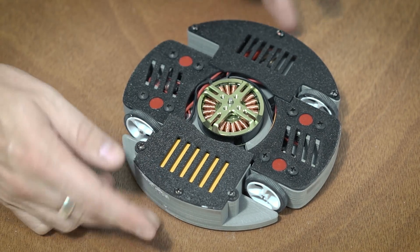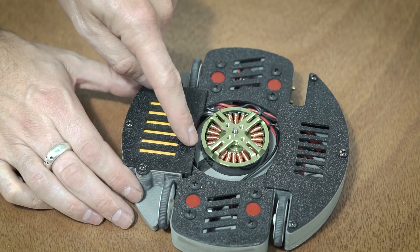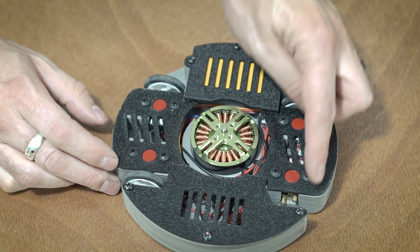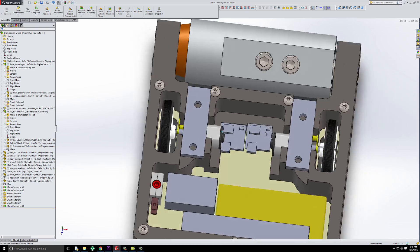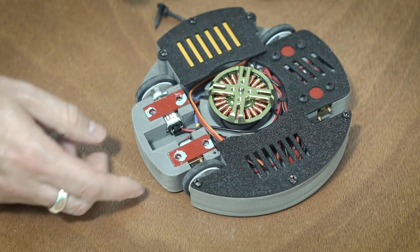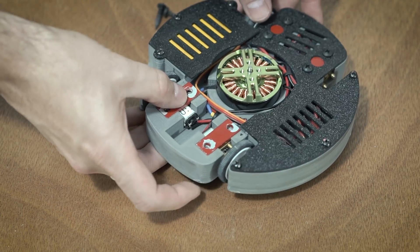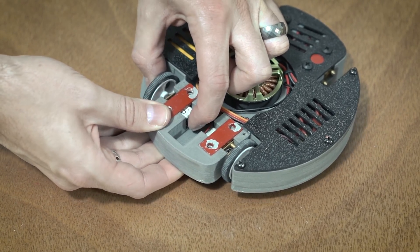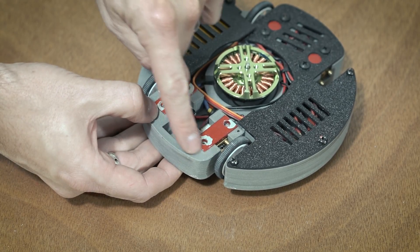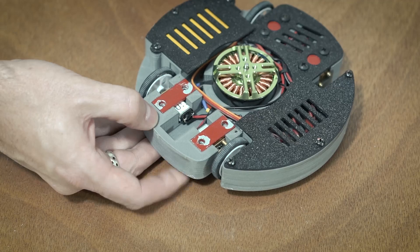One of the things I really liked about this robot was how fun it was to design. I liked the modular approach — the center hub that everything routed around, the battery compartment, all the electronics, and these two drive pods. The drive pods were very similar to the design on Sergeant Cuddles. Underneath the armor, there are two aluminum plates painted red just for show. They press down onto the motors and hold them in place, but the motors have a little room to slide sideways. The screws go through the armor, through the aluminum, and into really thick walls in the chassis.